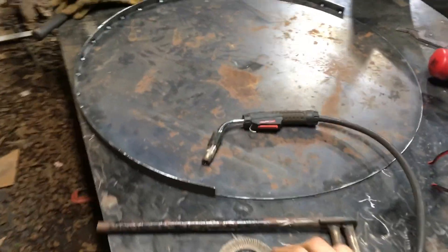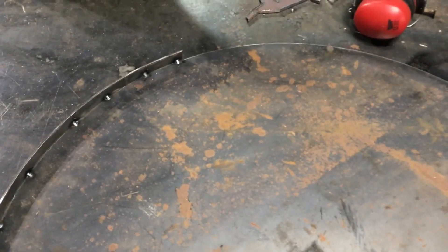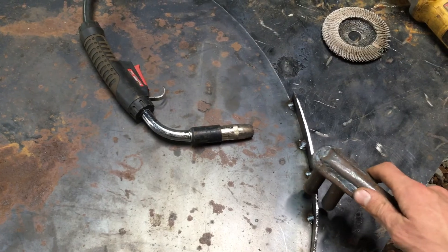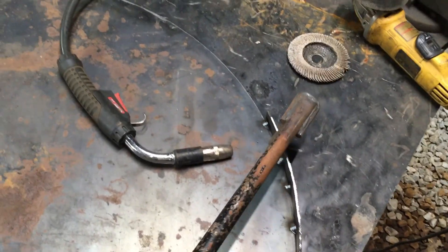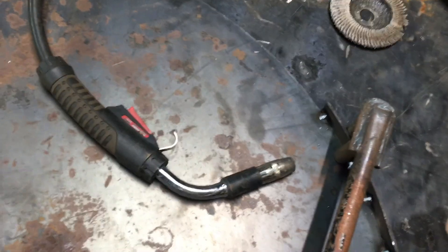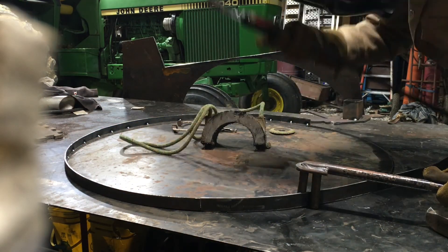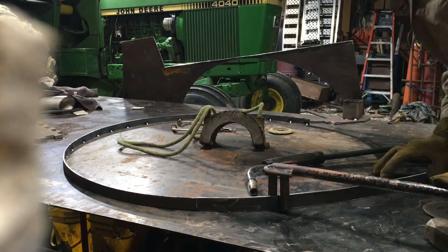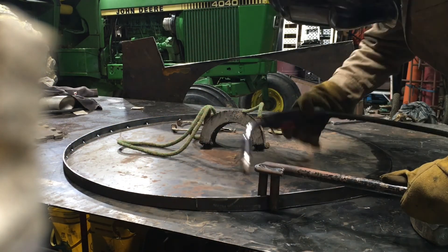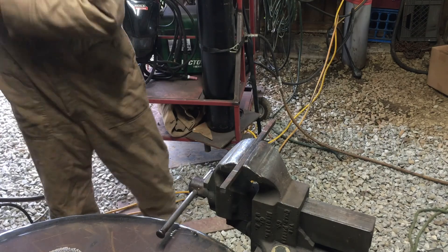I have to put on this circle a piece of one-inch strip. I just cut it out from the bigger sheet you saw me do before, and I have to finish this other section. I'm just taking my scroll fork, pulling it in here, grabbing it with one hand, and then with my other hand I'll take the MIG gun and put a tack on there.